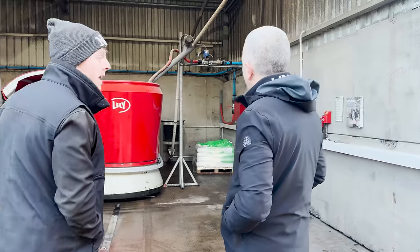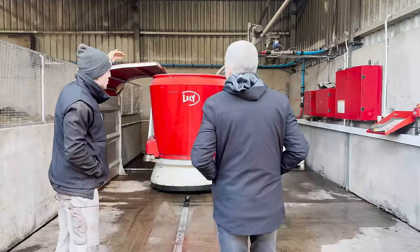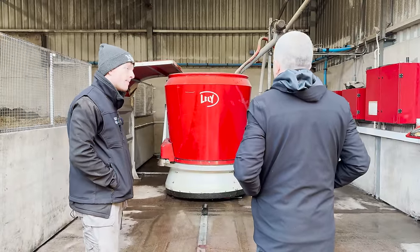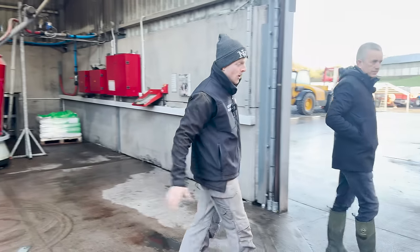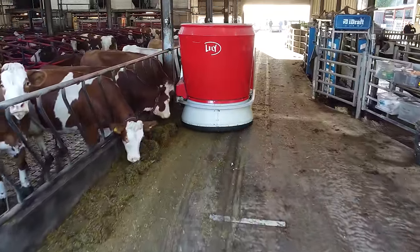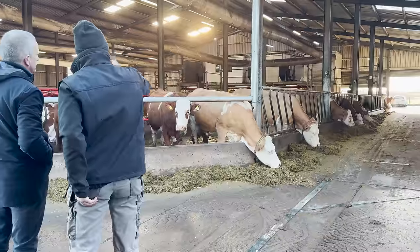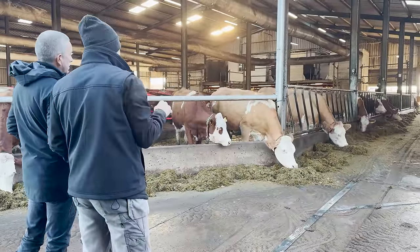You're not limited in what you can put into the vector — that's probably the beauty of it. There's also a shield here: if a bit drops you can scrape it in, because otherwise stuff lying everywhere might stop the vector from getting in and charging — when it's loading, it's always charging. The system follows metal tracks on the ground and bounces off barriers. On route one or route two it'll either push in the feed or feed at fence one or two — fence one is the first two barriers, fence two is the second two, and fence three covers one barrier each side.